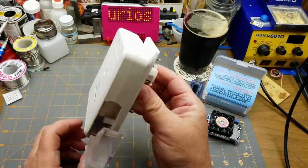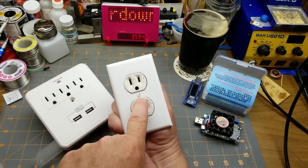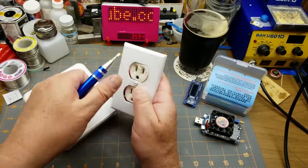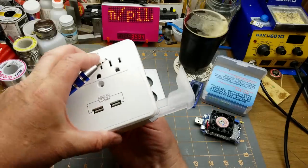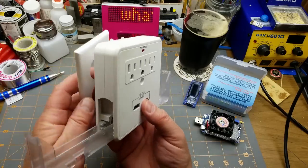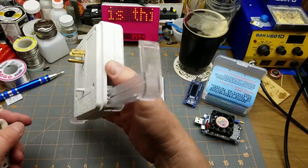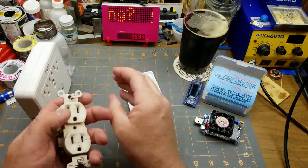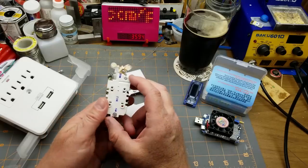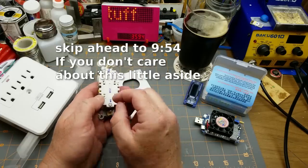This plastic tab goes into the grounding pin of the bottom half just for mechanical stability. That hole there — if you have a long enough screw, you can pull out the cover plate screw and drop a really long screw down through to lock it right on and cover the entire opening in the box. That would be a number-six screw, maybe an inch and a half long. North American viewers can skip ahead a bit, but for the rest of the world who may not see these every day, I'll explain.